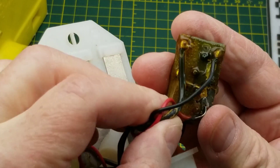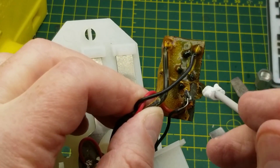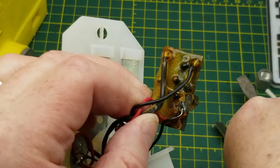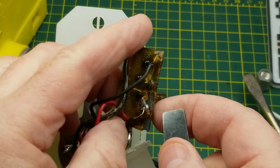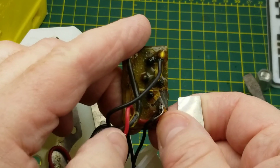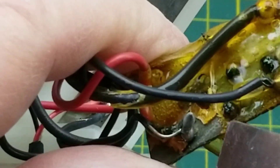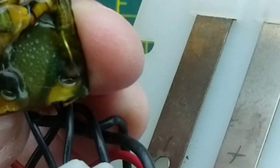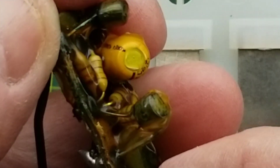Looking into there, I don't see any traces on that board at all, though I do see some discoloration there which looks like weathered copper — but it doesn't scrape off. So maybe that's just a tag board with six rivets through it, and then everything is just soldered to those, all point to point. Well, that's all nice and vintage.